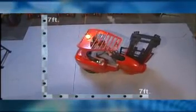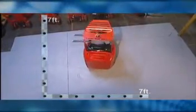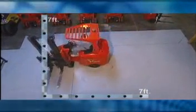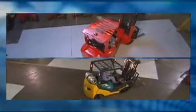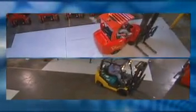The Flexi G4 from narrow aisle works in about half the aisle space of a conventional forklift, only 6.5 to 7 feet, just 3 feet plus the depth of the pallet. Allowing warehouse operations to decrease aisle width by 30 to 50% and increase rack space proportionally.